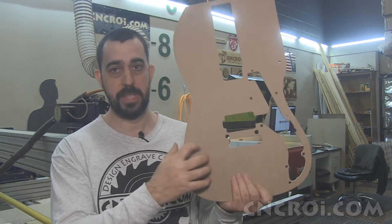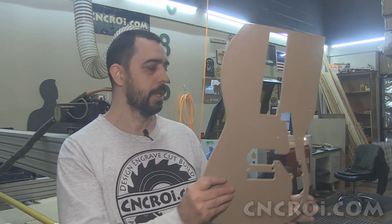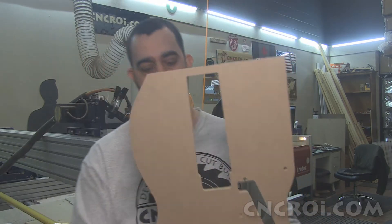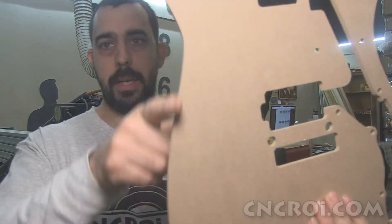In this case specifically, it's not a high volume sort of production — they're not making thousands of these. If they were making thousands, we would have made these out of mild steel or stainless steel. But they probably have maybe a dozen or so, so this is more than strong enough. It's quarter inch, or six millimeters thick, MDF. It's going to last a really good long time, and you can't beat the precision of CNC because everything is nice and curved.